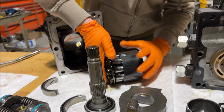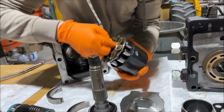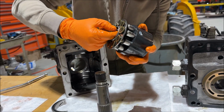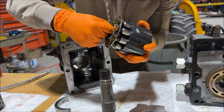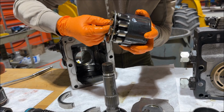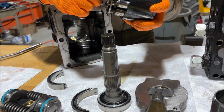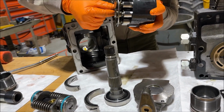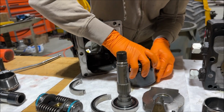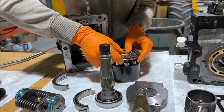Now, the only two places I know of that use swash plates are swash plate pumps and helicopter hubs that control the flapping of the blades. Because on a helicopter, when the blade advances, it needs to be at a flatter pitch than when it's retreating, due to the fact that the wind's blowing at it when you're going forward, and when the blade comes around the other side of the helicopter, the wind's chasing it. So you got to have a different angle to have the same amount of lift on both sides of the helicopter and not roll over.